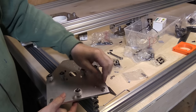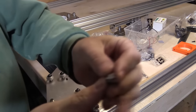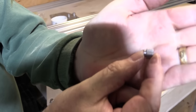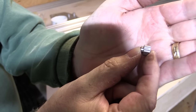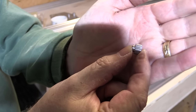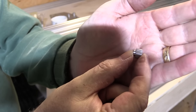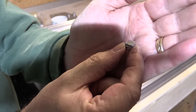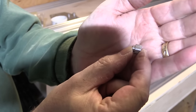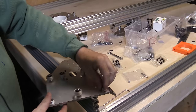Before you tighten these down, there is a little ridge on the bottom of an eccentric spacer. See that little notch cut into the face? That indicates the low spot for the eccentric. So if that is facing furthest away from where the V-rail extrusion is going to be, that will be the loosest fit. You want to put them into the plate in that orientation so that you can get them onto the plate easily to start with, and then adjust them later.